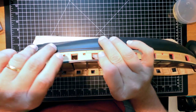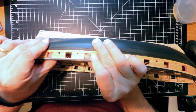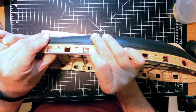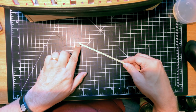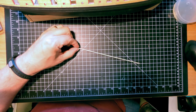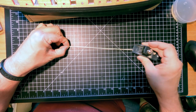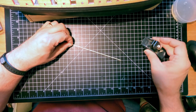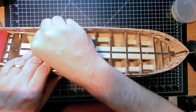So I'm working on getting that done. Looks like I need to thin it, make a little bit narrower board to make it fit. I notch out around the gun ports but I think it's working pretty good. What I've been doing is I got this back notched for the transom, then taking my plane and just taking shavings, a little bit off of it to make it a little bit thinner. That way it will fit in there and cover everything up but not go over the top of the gun ports themselves.